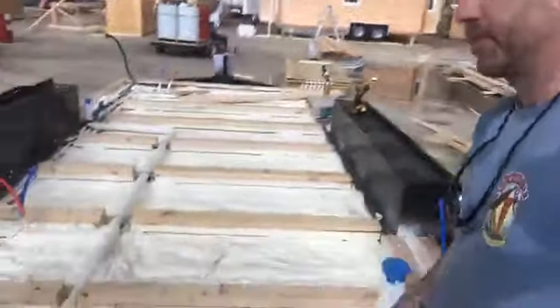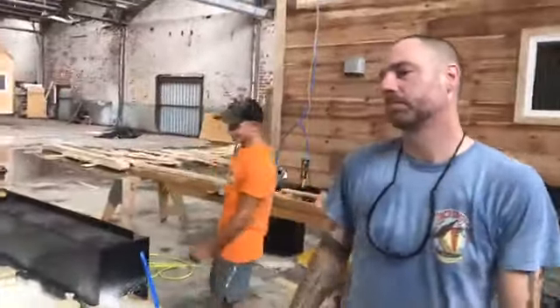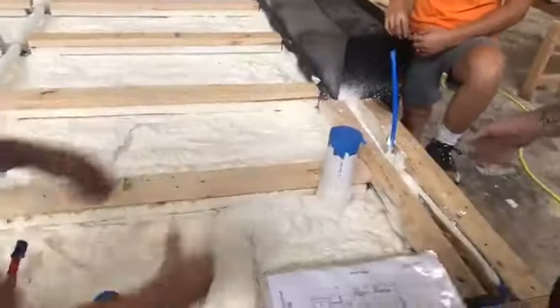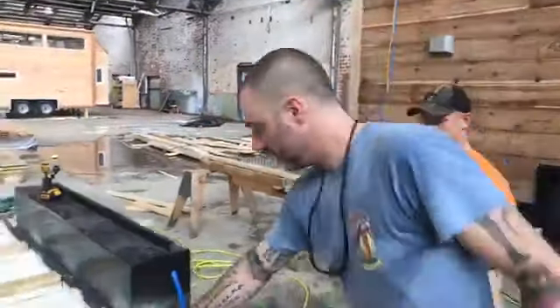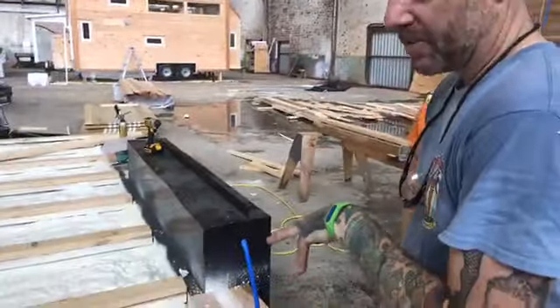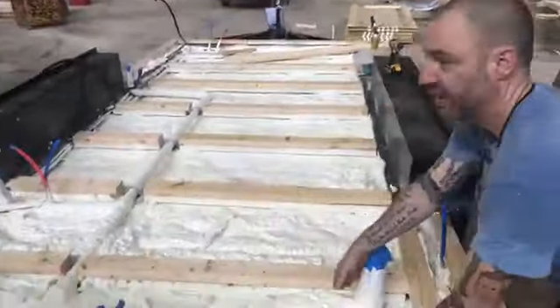So this is where all the big three-inch lines were. You and I were trying to sort it out, and we basically just reverse-engineered it. How did you know where to put that toilet pipe? We looked at the prints. The toilet is 12 and a half inches to the center of the drain from the interior wall. So we figured the two-by-four wall plus three-quarters of an inch, then pull our 12 and a half from that to the center — that's like a cornerstone to start. All this plumbing down here is three-inch. I wanted to lay out all the big stuff first, make sure it all fit, because I had to put it all in this one cavity. So this thing kind of snakes around and has to tee up for the sink and the vent.